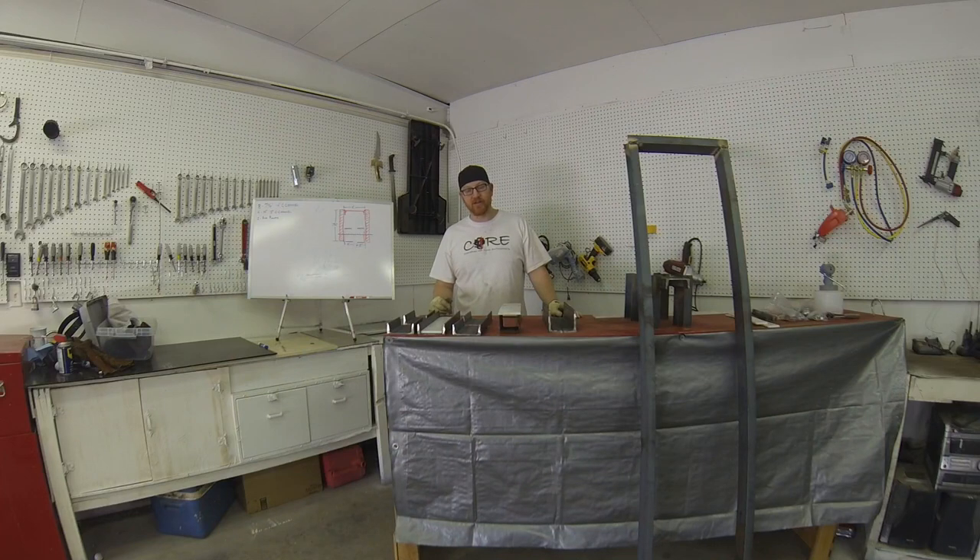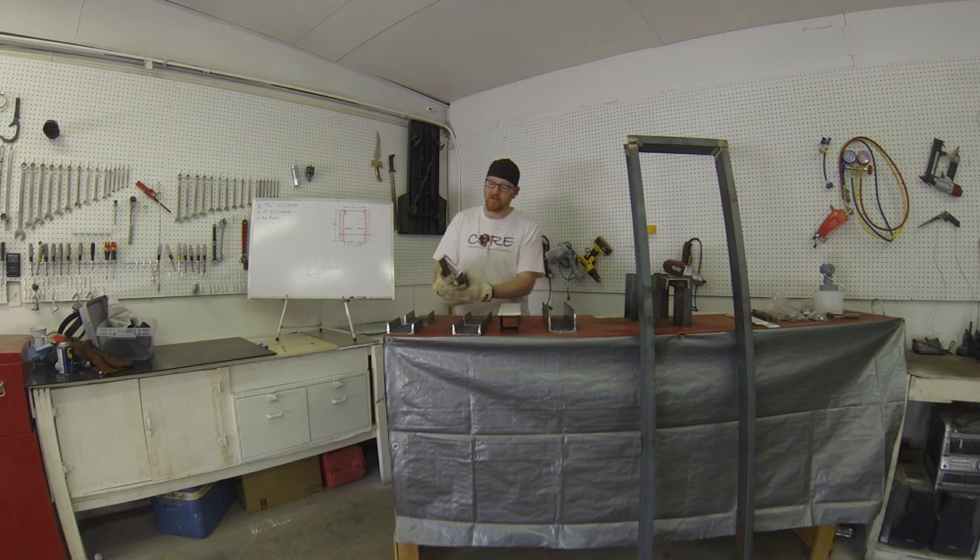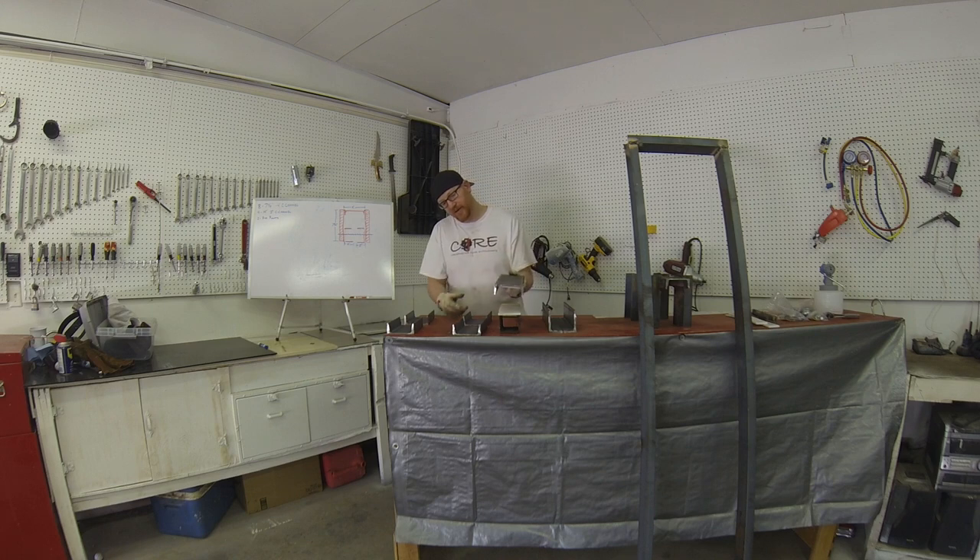Let's talk about the needs and dimensions we had to meet. We're going to have our square tubing — this will be our tongue and our slider will be mounted on top of that. Then we've chosen this 4-inch channel to be our top slider, and we're going to have a strip of HDPE plastic mounted to the bottom of that, so this will be sliding on top of this.